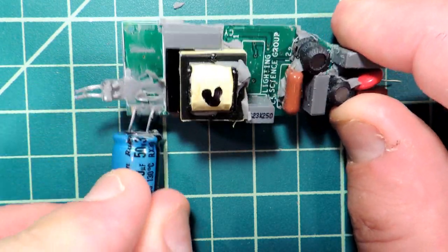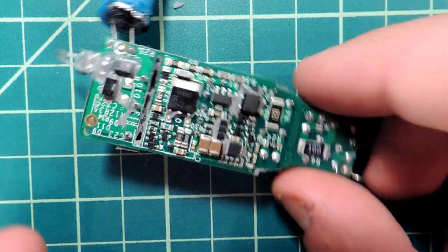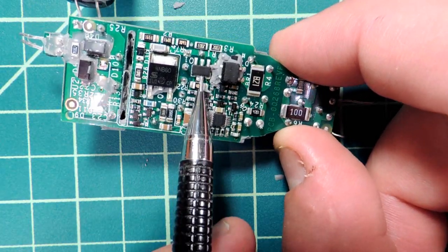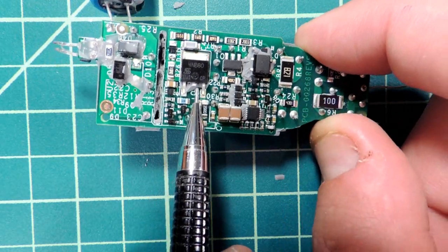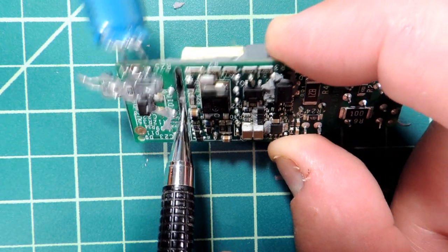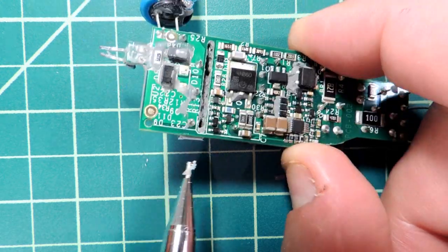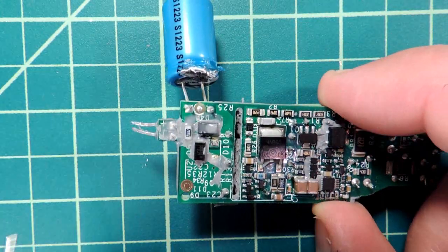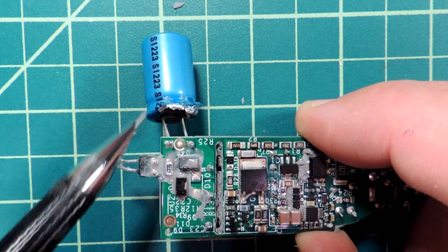The blue item here is a DC smoothing capacitor. This is a switching regulator. Flipping it over, we find a controller here, a full wave rectifier here, and a MOSFET which is the switching transistor. The slot cut here is for isolation purposes — it's good practice. I think it's probably only half-wave rectified on this side, though. This is what causes the flicker in a bulb — if this filtering capacitor and filtering circuit isn't done really well, you get a lot of AC components and therefore flicker. This is also one of the items that has a failure mechanism.